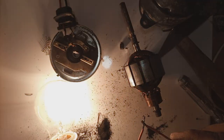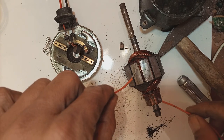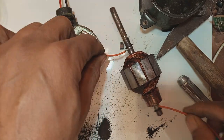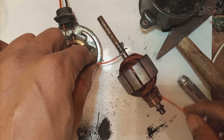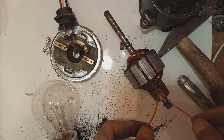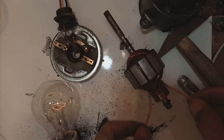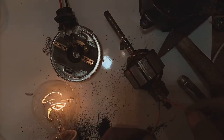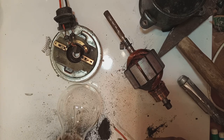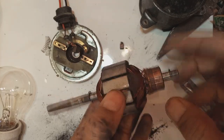The series lamp is connected in series with 220-volt supply to test this armature. What we check is that there should be no continuity between the windings and the shaft or the motor body/core — the shaft should show no continuity with the windings. But between the windings themselves there will be continuity, as you can see, and that is normal. With the shaft there should be no continuity. This test shows the health of the armature up to some extent, and the armature seems good.